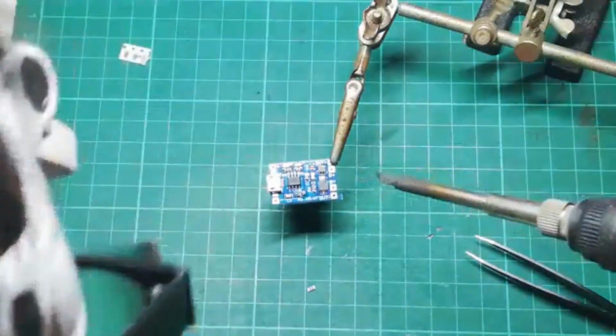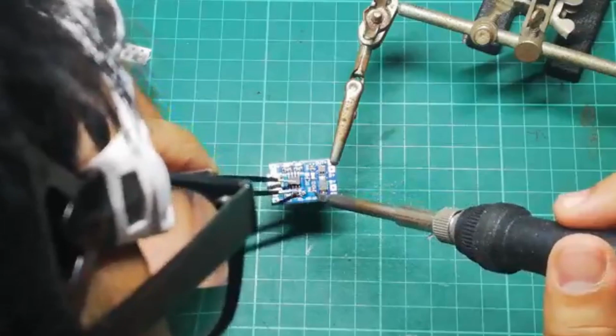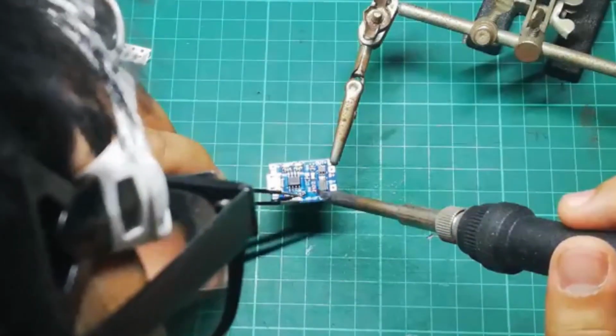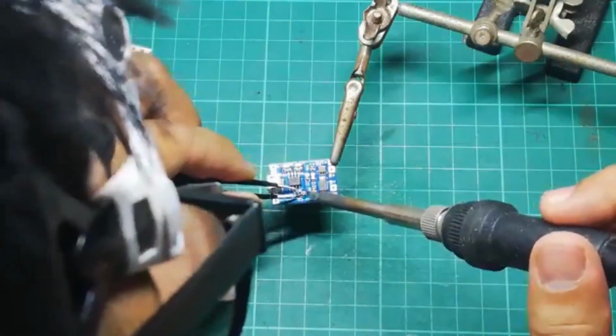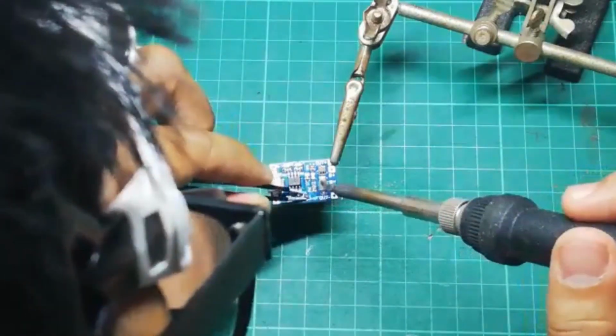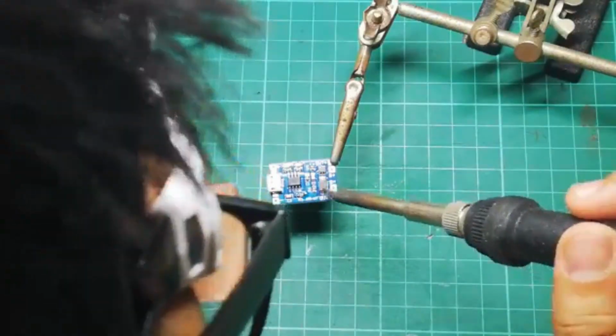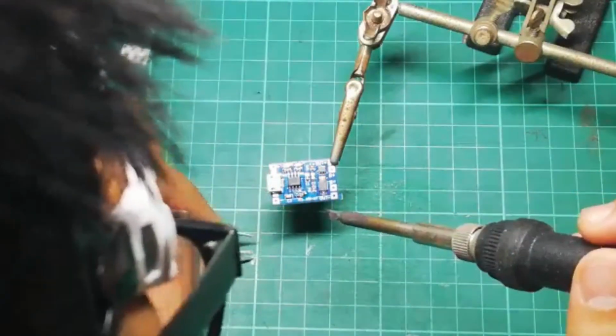A safe value is for me to half that, and using this table, I need to choose the resistor value that I need. Take note that the resistor that is included in the kit may be a bit larger than the space allotted for the R3 resistor. So just work around that. You could figure it out.